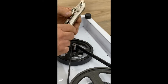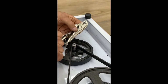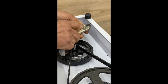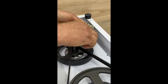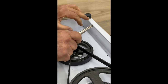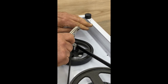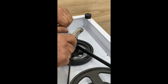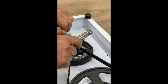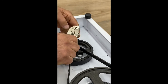You could readjust your pliers, but if you really don't need to lock them on anyway, you can just set them to a tension where you can squeeze hard without even locking on, because these screws aren't usually very tight. Just at first they may be a little bit tight, because when they break off you may get the threads set into the sheet metal a little bit twisted in there and bent, but that'll be gone in about a quarter of a turn, and then it's just a matter of easy turning.